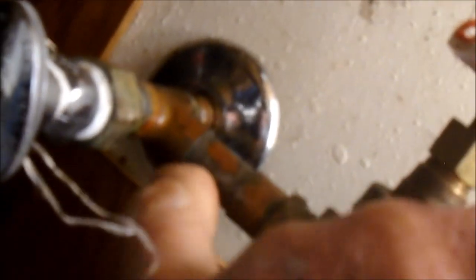Okay. Just remember, be careful when you take these off. I used heat, you can use it. You can see I used the torch here. Kind of heated up that a little bit. I got to pull that off because I just don't want to put too much pressure on this. I did not want to crack anything behind this. I didn't get it so hot that it melted any of the solder. This one here, I didn't get as hot as that one. This one actually hasn't been on as long, because they put this in afterwards. That one was a tricky one. Yeah, good to go.